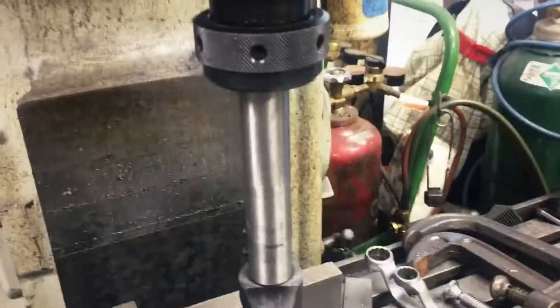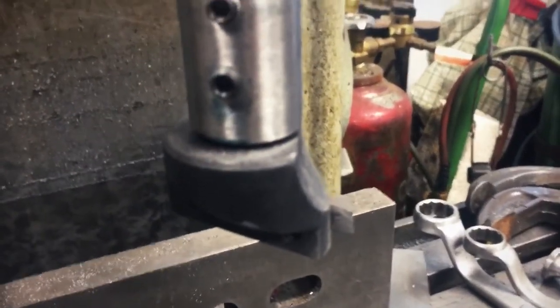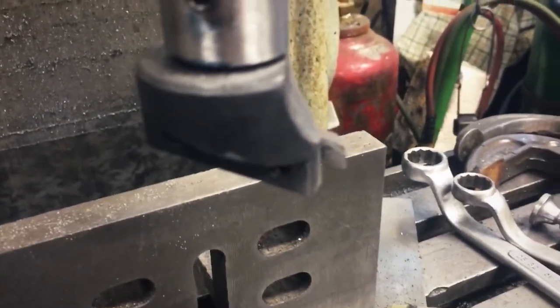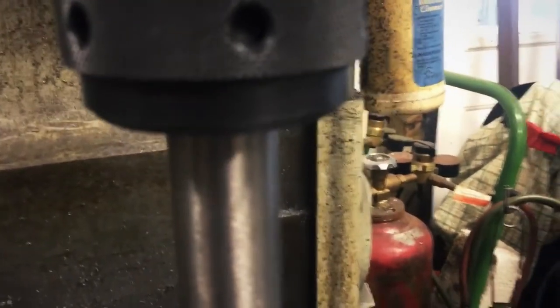Thanks for watching. And just real quick, for the boring bar itself, what a rigid setup. I take a piece of 1-inch cold rolled. There's the set screws in it. Put the fly cutter in. Like I said, I measured it with my test piece to get me the bore I needed, exactly 2 inches. And I have a nice collet in there. Of course, that goes the whole way up in. It's long. What's nice about that is I can reuse this. But boy, is it rigid.